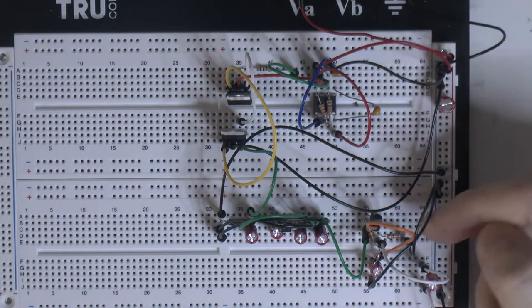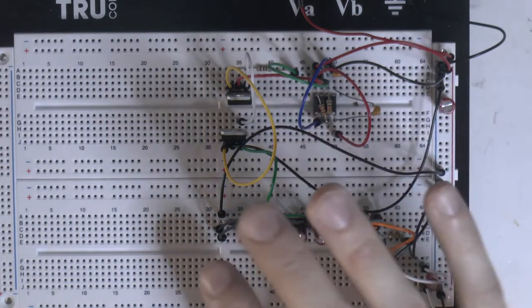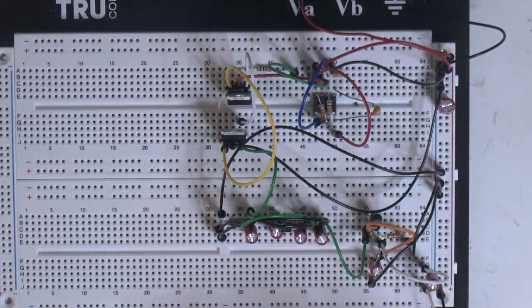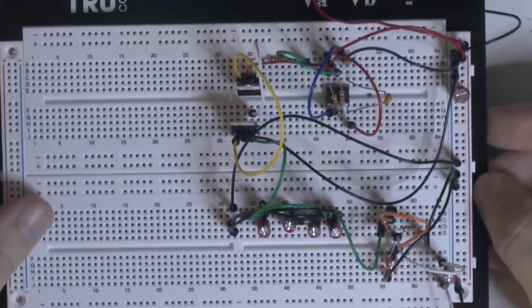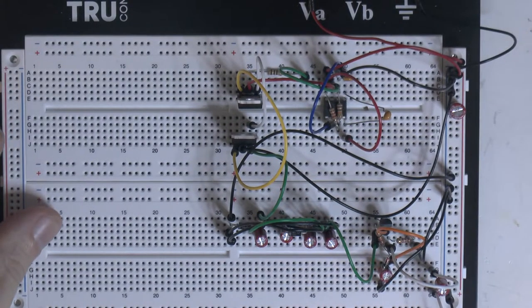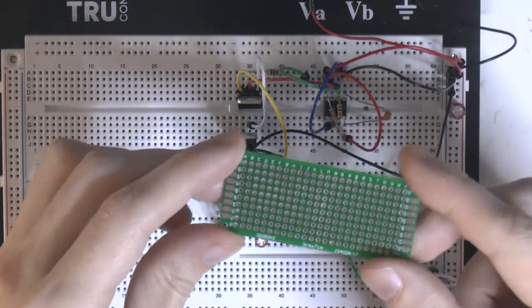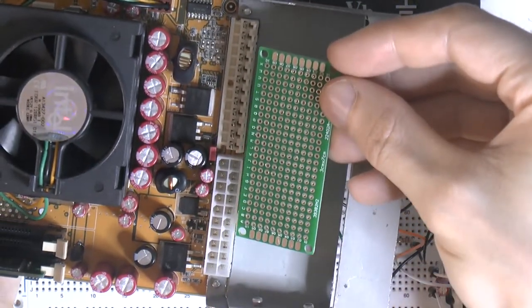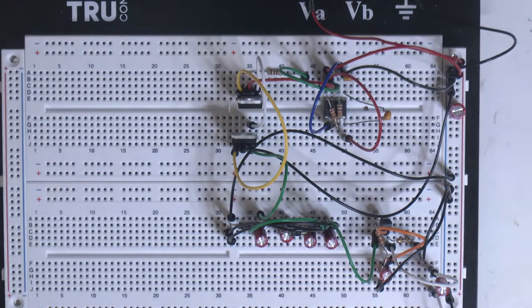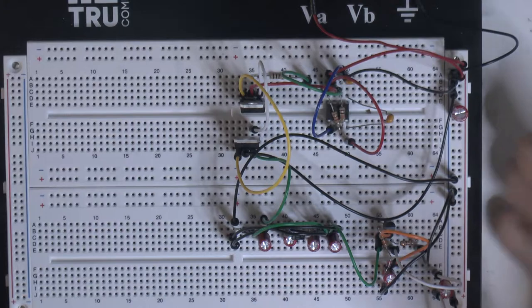Like with everything there's some losses — about a one volt drop over the transistor and the diodes have roughly one volt each too. The idea is to put this onto a small PCB, something like this, and mount it somewhere around here. So what we can do is hook this up and take some measurements to actually see that this is working.